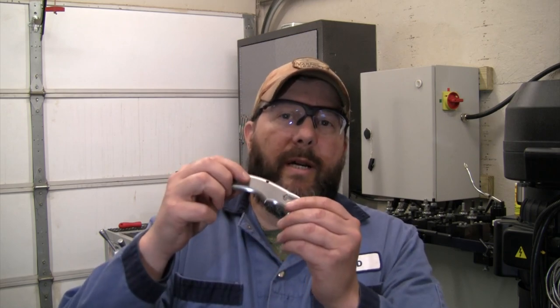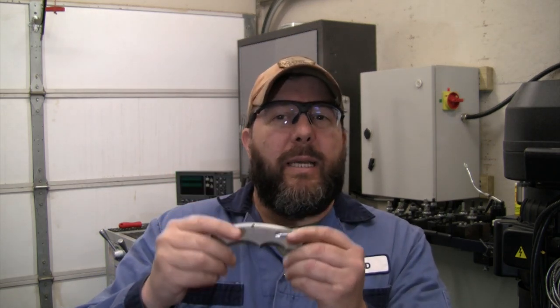And after we get the holes tapped, then the other part of this video is going to be cleaning up the contours on here and just making sure we get a nice blend. Ultimately, I think I'm going to bead blast these, but I don't have a bead blaster right now. Got one on order, probably get to that for the next set of handle slabs that we do. But I'm going to try just a Scotchbrite wheel. So I ordered a Scotchbrite wheel, and we're going to use that to go around the outside of this, blend these contours a little bit, and try to get these handle slabs looking complete, finished, and looking uniform and looking the same. Tap some holes in here, get the outside contours looking the same. That is the goal for this video, and setting up and getting this Tapmatic into operation.